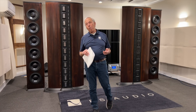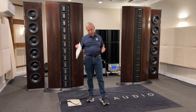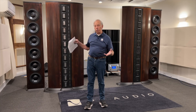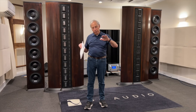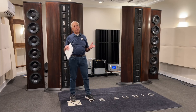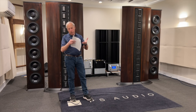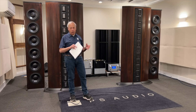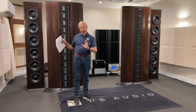To be clear, modern day amplifiers and preamplifiers use all sorts of means. They use potentiometers, which is the old style — a variable resistor to go up and down, to limit the output going into a fixed-gain amplifier. But for the most part, these gain and volume-controlled devices are within the preamp, and that feeds somehow a fixed-gain amplifier.